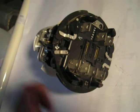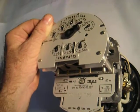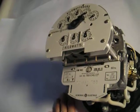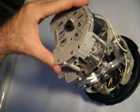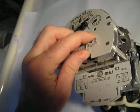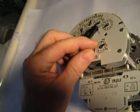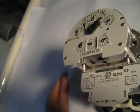These are spark gaps on here for lightning protection — it goes to the metal ring; I've got the glass globe off. On a three-phase meter, this is called a seven-jaw meter. There's also a five-jaw meter used on a 12S. This reads out in kilowatts and it's a demand meter also. What that means is the interval period is 30 minutes, so if you turn something on for just a few seconds it's not going to register, but if it's on for 30 minutes this is going to integrate up and show the peak kilowatts used.